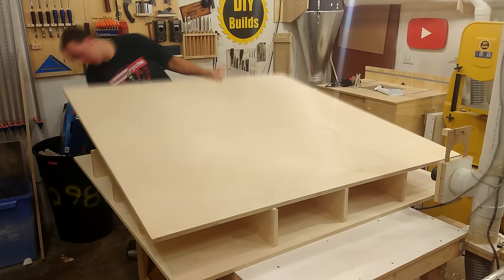The first step is to use three staples on both sides to attach the guides, using the slider as a spacer in between. Then I take the top piece, put it on top, and drill four holes in each corner, being sure to look out for the staples and to make sure I'm drilling through the guide. Then I mark out the location of the hole, drill a pilot hole, bring it over to the scroll saw, and cut it out to final size.